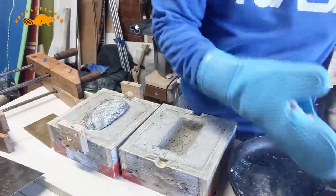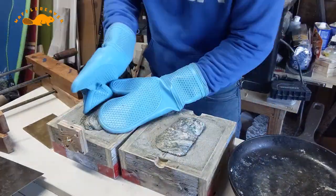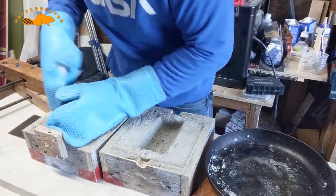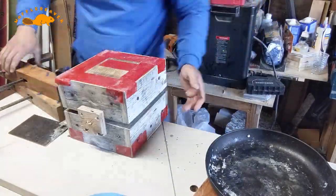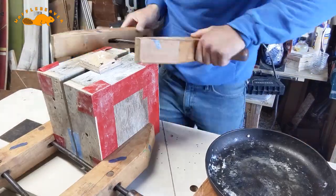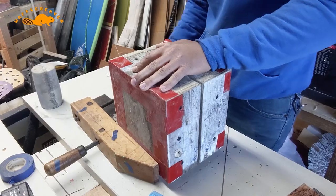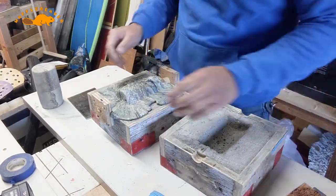This first attempt at casting was a fail because I was going to try to separate the molten plastic into two pieces — I could tell it was cooling too fast in the middle, so I put the pot back on the induction plate and tried again. This time it worked out, so I closed the mold and clamped it together using large clamps, adding pressure as fast as I possibly could. I let the plastic cool down for at least half an hour — the longer the better — and the reveal is always fun.